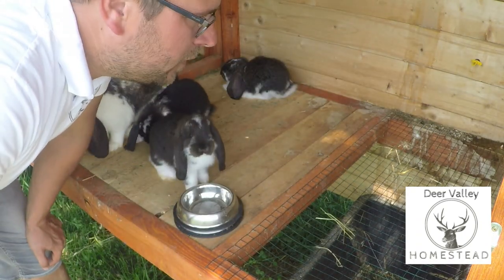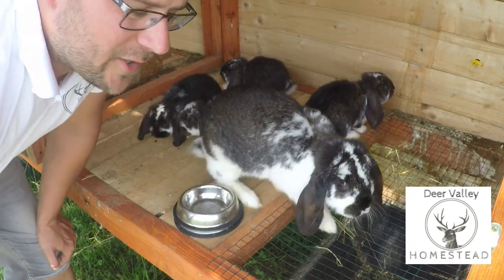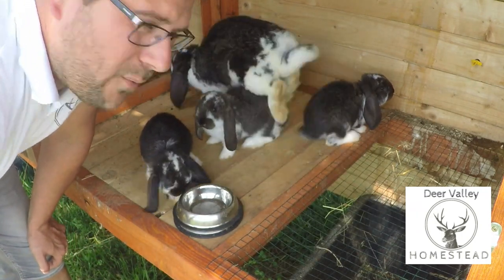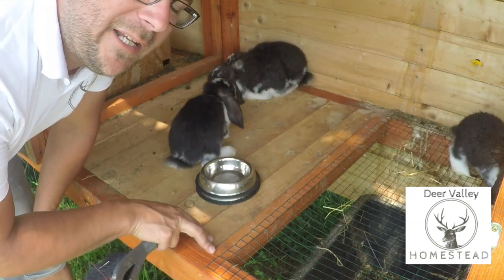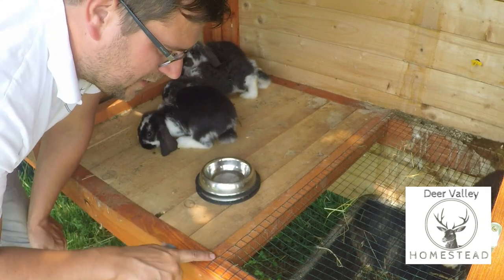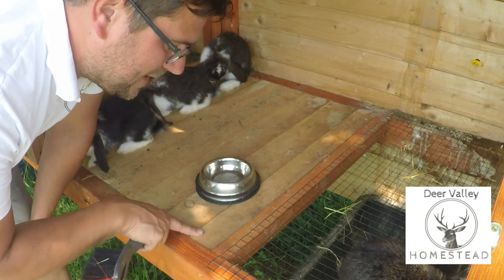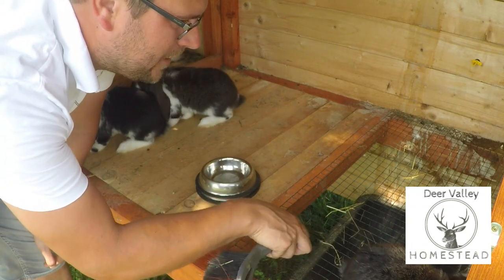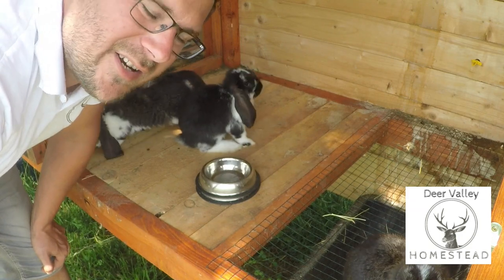For me I think that's quite manageable. Of course it would be nice if it all went straight down, but I also don't want my rabbits on the mesh all of the time. One of the small mistakes I made: I cut these boards and made them fit the space perfectly, but I should have left a little bit of room for expansion. That's why you can see this middle piece has been pushed across slightly as they've got moist and expanded, leaving it slightly saggy in places. It's not too bad but it's not ideal.